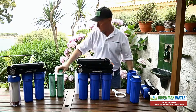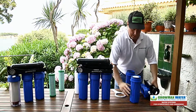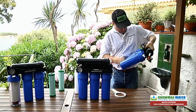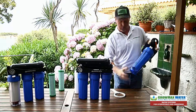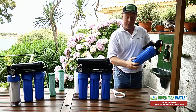Take out your carbon cartridge, put in your new one, and tighten them back up. When you re-put your filter housings on, you don't need to use the wrench. You should just tighten them as far as they'll go by hand — that should be enough.